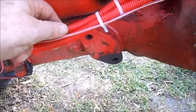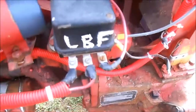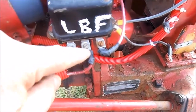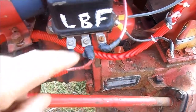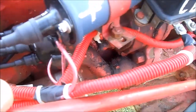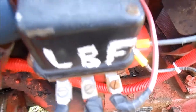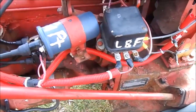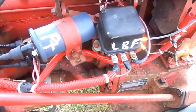The two looms are coming this way — one is going to the electrical, the load and the battery, and the other one breaks off here and goes to the coil. Everything is marked: negative and positive on the coil, LBF on the voltage regulator, and FA on the generator. Everything is clearly marked so there's no second-guessing for whoever else might come in here after me.